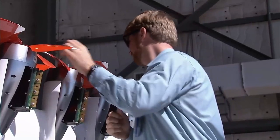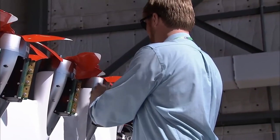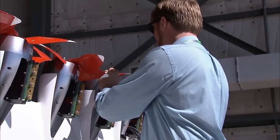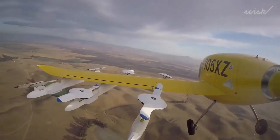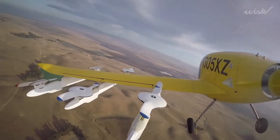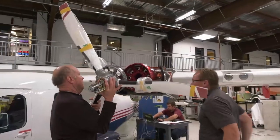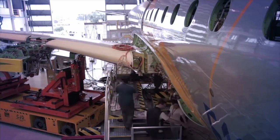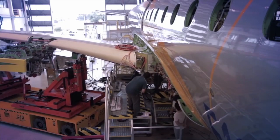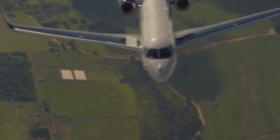One of the benefits of having an electric aircraft is that distributed propulsion can be used to enhance propulsive efficiency. Most purpose-built electric aircraft have taken note of this, as it is one of the ways through which the available energy gap between fuel-burning aircraft and battery-run aircraft can be reduced. Simply retrofitting an electric motor in an existing airframe to replace an IC engine will never give the range achievable with a purpose-built electric aircraft.